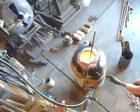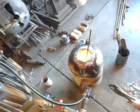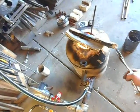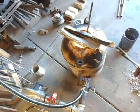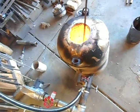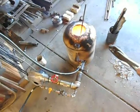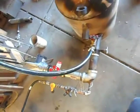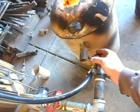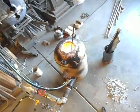And that's why I'm not getting a very good burn. The soot around the top of the foundry is from breaking down some stock by just laying it on top to heat it up — once it gets hot enough, it breaks apart real easy. Now you can see the flame is starting to die down. The foundry really doesn't seem to like this automatic transmission fluid, so I'll just open the valve a tiny bit.